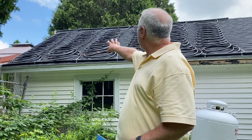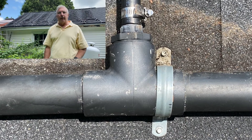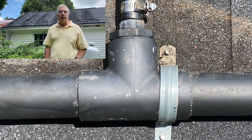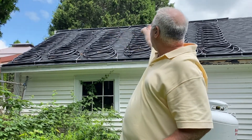It's really a very simple design. I have coils of irrigation tubing and a manifold at the top and bottom that I built out of PVC and fittings to connect those coils. It's run by the pool filter, which pumps the water up to the top manifold and then gravity feeds the water down through the coils and out to the pool.